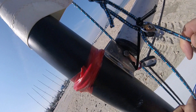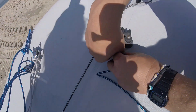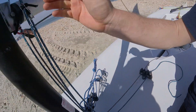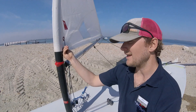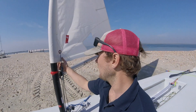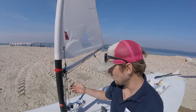The longer piece of rope goes through the pulley there, then through the pulley on the deck, and through this cleat on the deck — just cleat that off. There are different ways to do this. You can have both bits of rope on the same side of the gooseneck, which allows you to pull the sail down further, but over time it damages the sail more. We like to take it either side to restrict people pulling the downhaul on too much and make our sails last a bit longer. You can have different systems with more purchase, but we like to keep it simple.